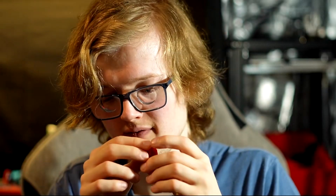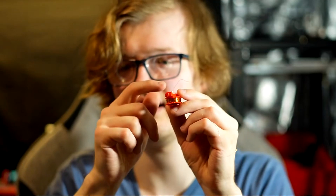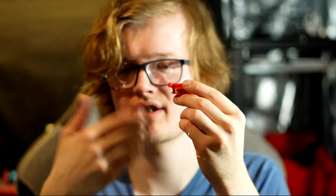A couple of other features I forgot to mention. Firstly is the method of fixing the coils to the base of the generator. Instead of having protrusions that stick into slots on the base, what I've done in this iteration is add holes here that you can just screw and nut the coils into the base with, making these coils able to be much more securely held down inside the generator. Before, in my previous Modicoil generator, a problem I had was that some of the coils were a little bit loose using the slots and protrusion method, so I've just gone — screw it, pardon the pun — and made some screw holes so these can be screwed down onto the base.